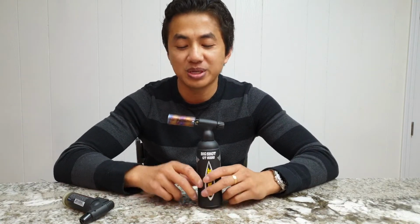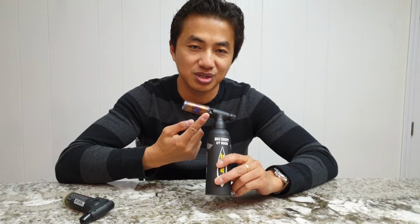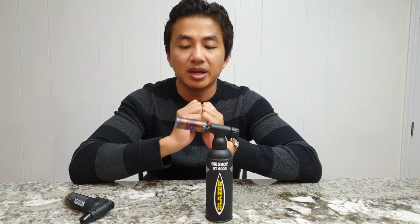And one other thing to notice, if you're going to do heated colors on anything, make sure to do the screws, otherwise it just won't look very nice. So, in summary of all of this, adding abrasions to the surface of the metal or having the surface polished will bring out the colors vividly. Stainless will not bring out colors as nicely as titanium. I don't know why, I guess it doesn't oxidize the same. But I just know that polished, mirror-finished titanium surfaces will bring out colors really nicely. Stainless, you definitely have to do some polishing if you want any colors. Otherwise, you're just going to get a really dull, dark color.